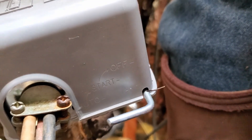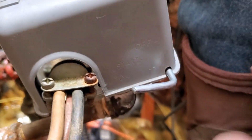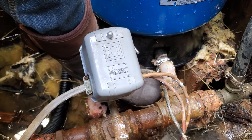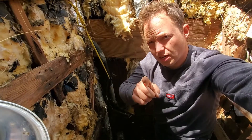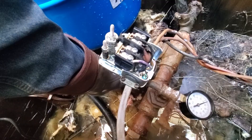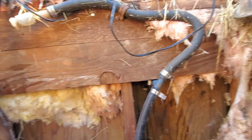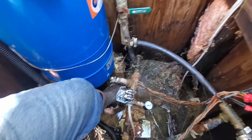Make sure you adjust the pressure in your pressure tank if you adjust the cut-in pressure of your pressure switch. One nice thing about this type of switch is that you can put it all the way into the off position to manually turn off the well pump while you're down in the well pit, because a lot of times you don't have a proper disconnect in the well pit. Comment down below if you still have a well pit — I'd be really curious to hear about it. I did want to give an honorable mention that this is one of the worst well houses I've ever been in — I highly recommend not having a well house like this, and it definitely needs a lot of work. A wood basement on a well house is just absolutely terrible.